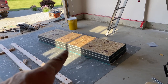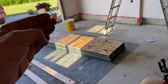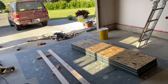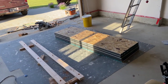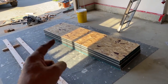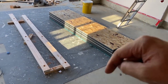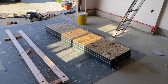I've got all four shelves now put together. This next step is vital in order to line up the shelves correctly with the threaded rods. These are the 2x4s that are countersunk — the threaded rods are going to hang down from these. Before I do that, I want to mark each shelf. I'll use the 2x4 as a guide: this is the front edge centered, this is the back edge off-centered. I'll use a half-inch drill bit just to mark it, and then use a 5/8-inch drill bit to finish drilling through — slightly bigger so as you put the shelves on, it's a little easier to cinch them up.